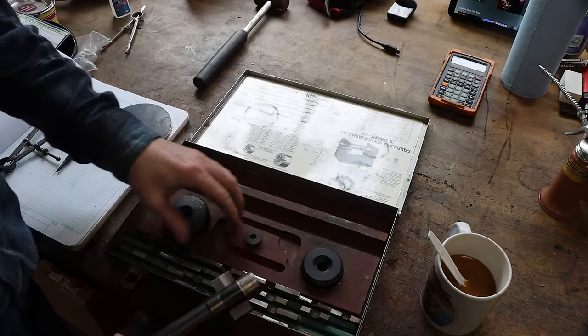So there's our slug fits in there. It's a little proud. That's fine. We'll have a gasket on here that's at least a couple hundred thousandths thick, so plenty of room so they can do a coating on this, but yet it still should not jam up. At least that's what I'm hoping. So what I'm going to do is bolt this guy on here, and then flip the whole unit over, center it up, and then just come in from the bottom side and weld it up.